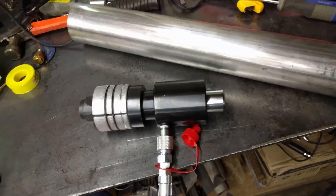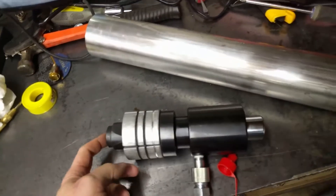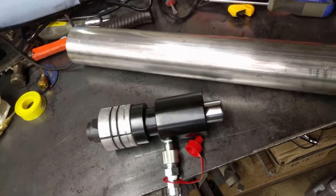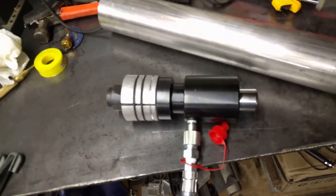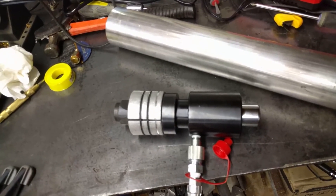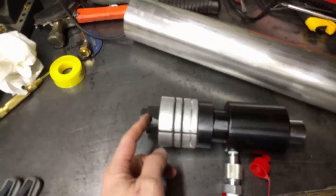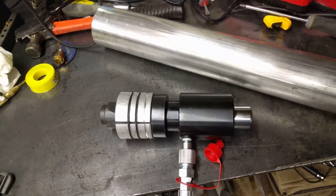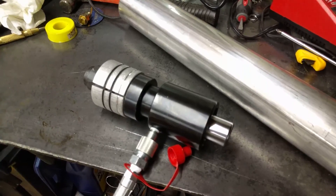I was a little bugged by some of the other videos — they just didn't show the stuff I wanted to see, like the fitment. They didn't talk about the draw stud and the threads, whether the nut and threading on this works. I was a little blind when I bought the three components. But as soon as I opened up the boxes and saw that all the threading was good and everything fit together naturally, it was just a matter of figuring out how to get the full stroke — and that was easy once I realized the bearing was what was in the way and that this piece was concave to fit the nut down into the center as it pulls in. Hope that's helpful. Take care.